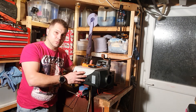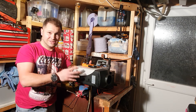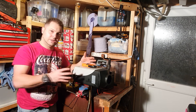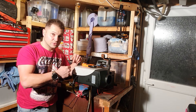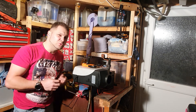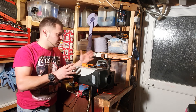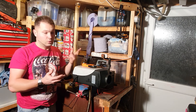This is a five kilowatt — the eight kilowatt and the five kilowatt are exactly the same, no difference at all. The eight kilowatt is just an over-exaggerated figure. The two kilowatt is going to be slightly different, but the same startup procedure applies — the glow plug still draws a lot of power, the fan is still running, and I believe it's the same fan. The only saving grace is it uses slightly less diesel. We're not here to test diesel usage; this is just so people get an idea of what leisure battery they'd need for this to run constantly or overnight.